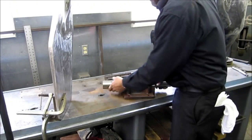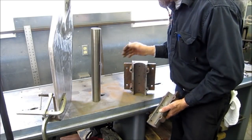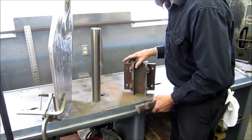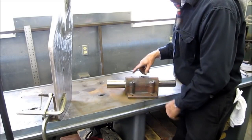What we have here is the shell out of the Babbitt bearing — it's for a 15-foot, 2¼-inch shaft we have, and it's going to carry some of the load. The Babbitt was worn and this thing was buried in grease. We're going to be re-pouring the Babbitt in here. We've got a dummy piece of shaft we're going to lay in here, make two shaft collars, smoke the shaft, pour the lower half, make a shim pack, bolt it together, and pour the top half to replace the Babbitt inside this bearing.